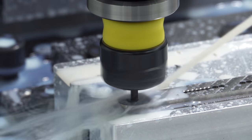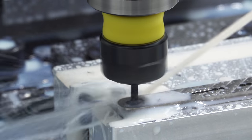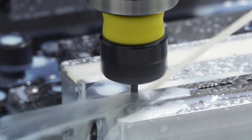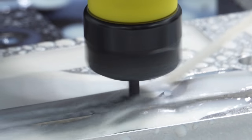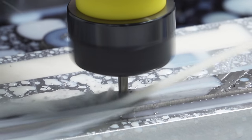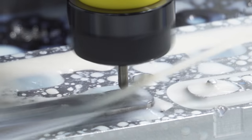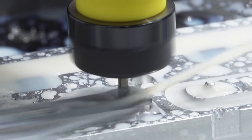For the other end mills, I couldn't go to proven cut, so I just looked at lots of speeds and feeds charts and tried to find something that seemed reasonable. My slotting strategy seemed to work, even with the smaller end mills. I didn't even really change the chamfer speeds and feeds from stainless and it still worked fine. In fact, I accidentally made big chamfers where I shouldn't have.